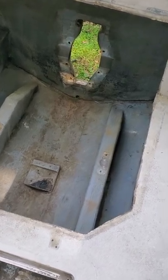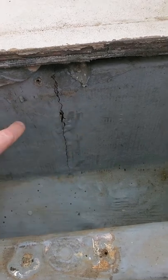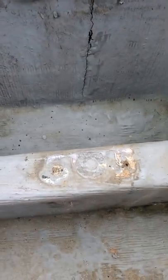We've got a full gut here. We've got the engine out. The transom assembly's out, and there's been failures of these platforms back here. I did a video a few years ago when I first got into this, and you can really see where some of the supports are failing here. The wood behind it's rotted. I think they're going to cut the decks out back here and then restructure this. The stringers seem to be okay — they sound solid, so I don't think they're going to have to redo the stringers.